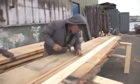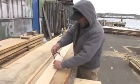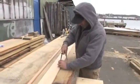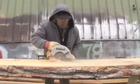The process generally is that we take a 2.5-inch white oak plank. It has to be spiled, which is making a pattern. And then we cut that plank out. The frames have to be flattened, or what we call dubbed, and the plank is ready to go on the boat. First we have to steam many of them because a lot of them have a bend or a twist in it. And this 2.5-inch oak is not very forgiving unless it has some steaming done to it.